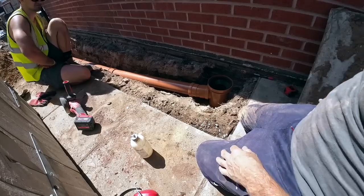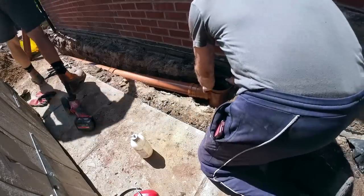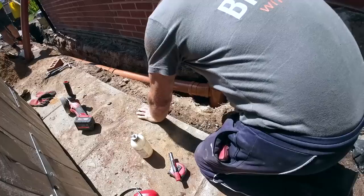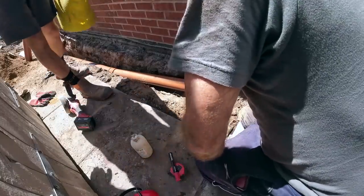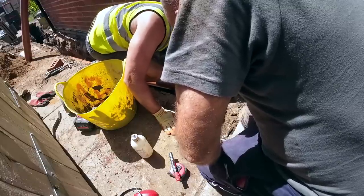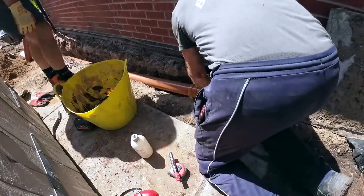Some stone around it. Just push that in that way a bit, mate. Just touch. That's it. You got gloves on? Yeah. Just scrape a bit of sand from underneath the bottom of it, it needs to go down to touch. Just the gully, directly below where I am. It's not going that close to the wall. A bit further across the trench towards me. That's it. Got it.